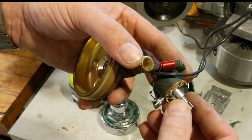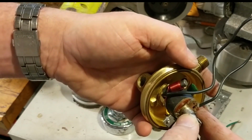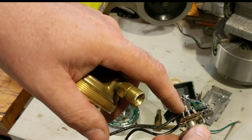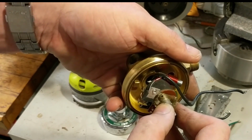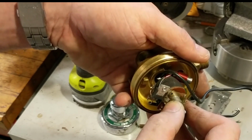And then I think we will probably pot this in epoxy. I think JB Weld would work great for that. I'll look up if the JB Weld putty conducts electricity. I'm pretty sure it does not. So I could actually just mount that stuff all inside that potting, and it will hold it in place for us and make it safe all at the same time.